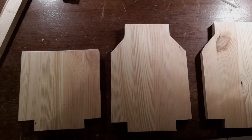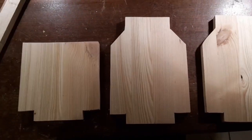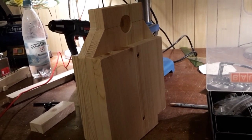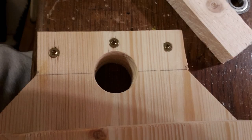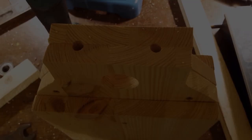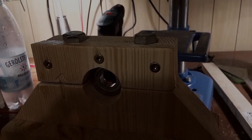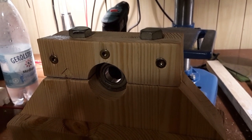So let's get it started. Start by sawing out AH1 and AH2, two times each. Now drill holes into AH1. The diameter of your holes should be the outer diameter of the bearings you use. Now screw these pieces together. Don't use glue, since you later may want to change out some of the parts. Also put some screws into the top of the part, drill holes vertically into the part, and saw the top of it off.